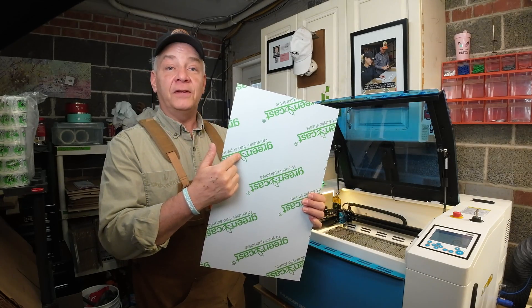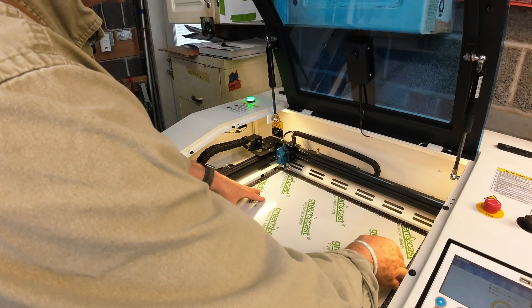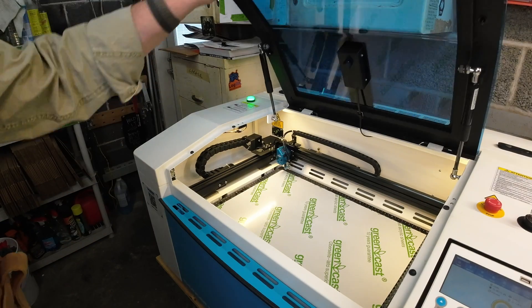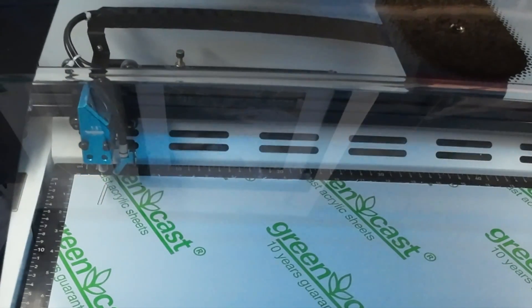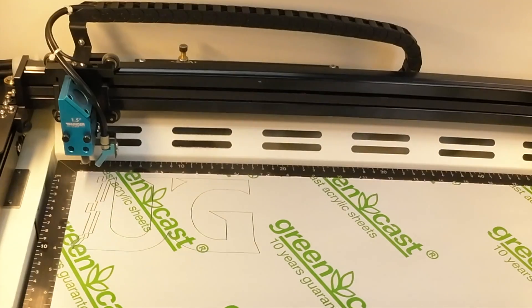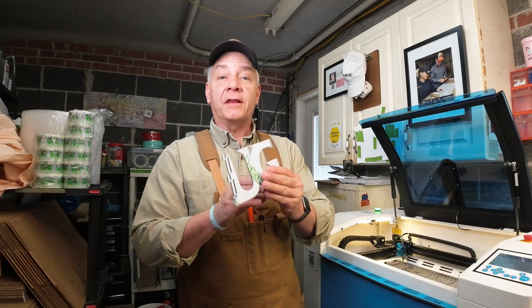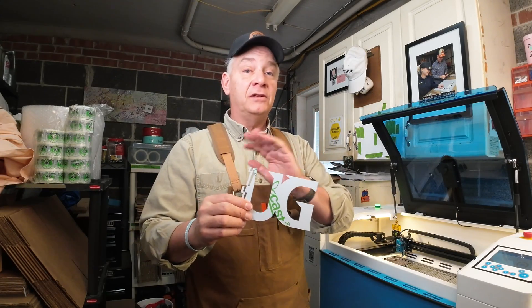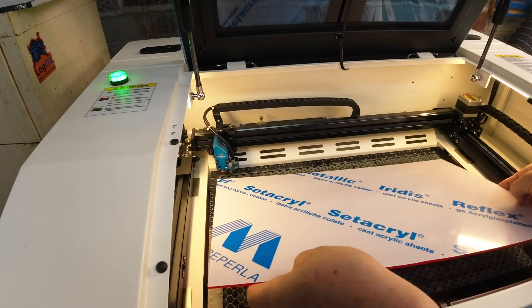To note, I'm leaving the film on both the front and the back — your cut settings will cut through it cleanly. I'm going to square it right up into the corner against the rulers again, autofocus it, set my origin and cut my letters. One of the nice things about cutting acrylic with either a mask or if you've got settings that allow you to leave the film on is there is zero cleanup — no cleanup. And look at how nicely those edges came out with the cut settings. We'll follow the same process for the rest of the letters.